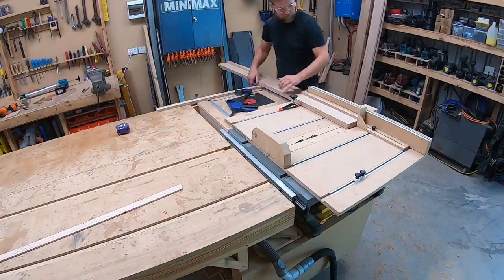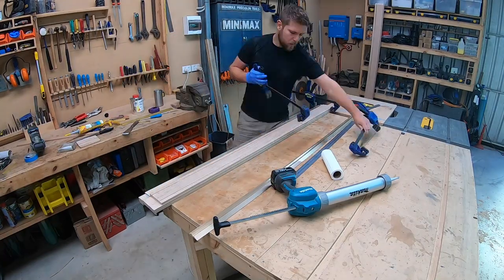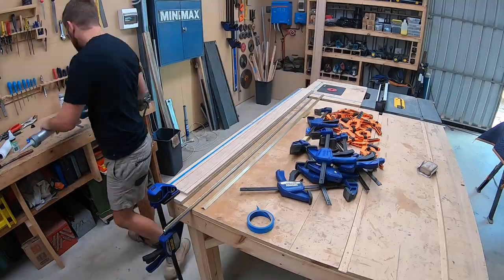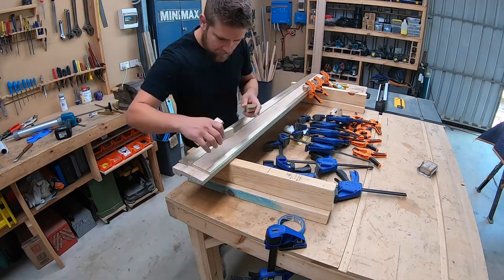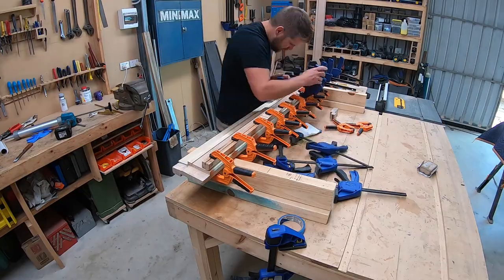The next step was to build the door seal. I machined that out of a solid piece of timber, where I cut the rebate from my doorstop down below so I can stop where they're getting underneath, and then inlaid some brass. I put the brass on the corners to protect the edges of the timber, and then a brass strip at the front that slopes down away from the trailer to move water away from the house, so the doors have something solid to seal up against.